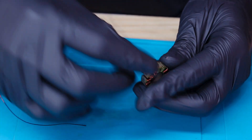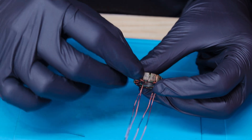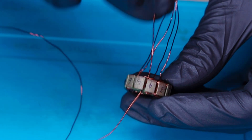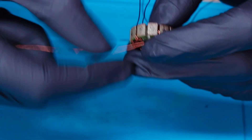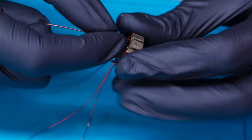The second phase is also completed. Now we are moving to the third phase, which starts with tooth number five in the clockwise direction. By this time you can see that two of the wires are coming out at the same slot — that's why this is one of the easiest winding patterns out there, as it will be very easy to solder the wires.